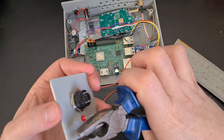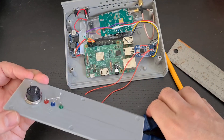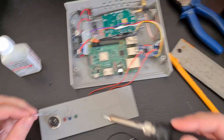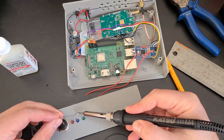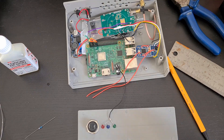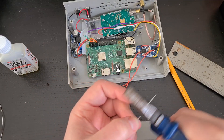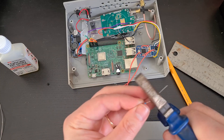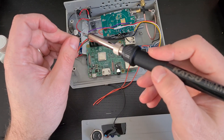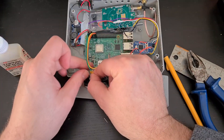I've twisted the cathode of each of the LEDs together and I'm just trimming the anode off so it's a bit shorter. The three cathodes I will solder together and then, using a little bit of black wire, I will add those to the Raspberry Pi USB port negative blob of solder. Once I've soldered these LEDs together they will all have the negative going in the same place, and by putting all the negatives together it stops there being too much of a ground hum. Just cover that up with some insulation tape so nothing shorts on it, and then we need some resistors.